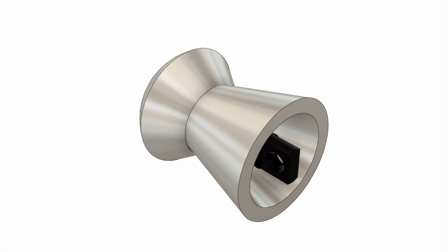And being such a shape, it's going to involve a great many machining operations, which is why this video is so long. It's also going to be very hard to keep hold of. The more I machine off of it, the harder it's going to be to keep hold of it, to carry on working with it. So it took me a lot of thinking and planning as to what order I was going to make this in, chiefly driven by how I can keep hold of the thing for the next operation.